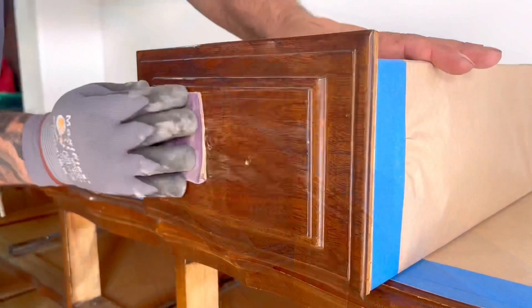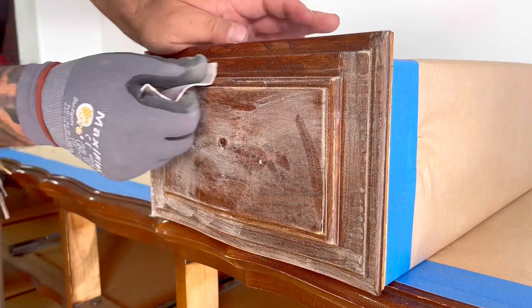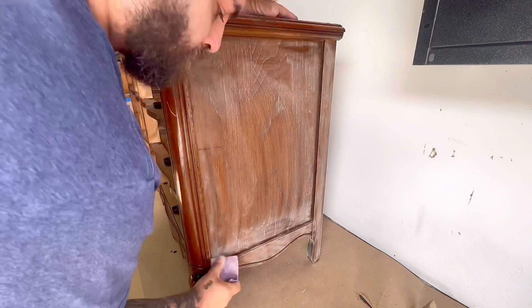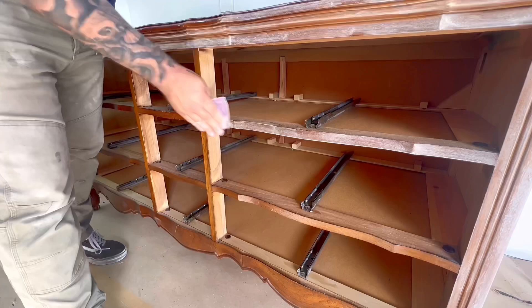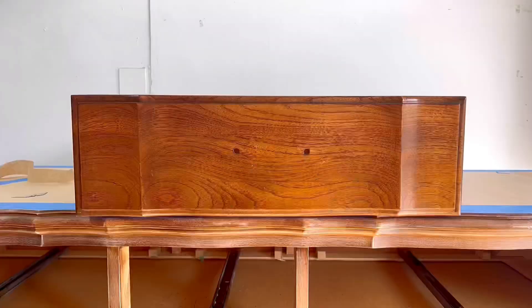For the rest of the dresser, since I'm painting it, I'm going to go over it with 150-grit sandpaper, maybe a 220, check for spots that need wood filler, and get it ready for paint. Sanding may be the most boring and tedious part of any project, but it is by far the most important. If you don't sand, the paint is not going to stick very well, and when you go to scuff sand your coat it's going to come off easily. Take your time, prep it right, and the project will go very smoothly.